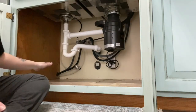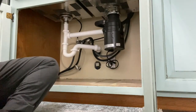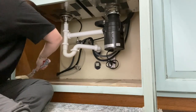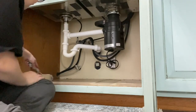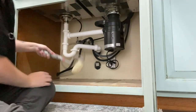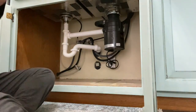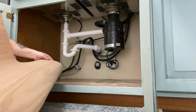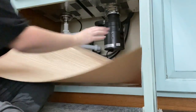Okay, so I rolled the glue out, and I just made sure — actually I just see a spot that I missed — trying to make sure I get as close to the edges as possible, because you don't want your edges lifting up. I think your most important areas for getting the glue are all the way up to the edges and in the corners so that everything sticks the way you want it to. So I have my piece of veneer that I've cut right here, and I'm going to go ahead and put it in under the sink.